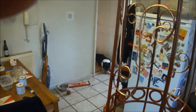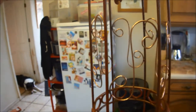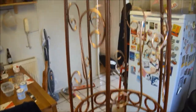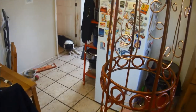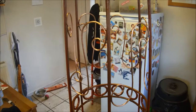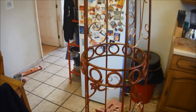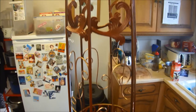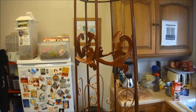So I bet you're wondering why I'm in my kitchen painting the frame up. Well, it's quite a nice day outside, but the temperature is below 10 degrees, and the paint I'm putting on needs to be applied at a minimum of 10 degrees. Although the light's pretty poor in the kitchen here and I've got my head torch on, I'm still going to have to put a second coat on after this when it gets a bit warmer outside — above 10 degrees. Just got to persevere with this, and then anything I miss I'll put on outside when the light's a lot better.